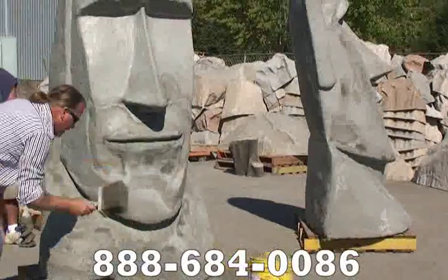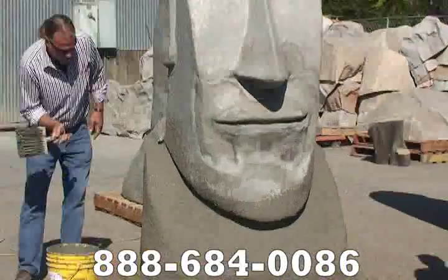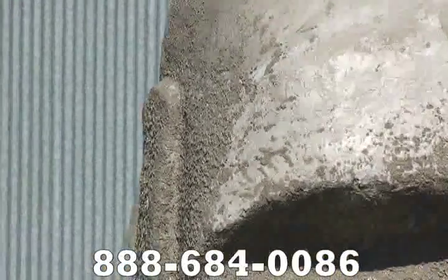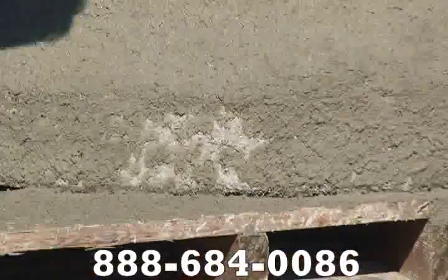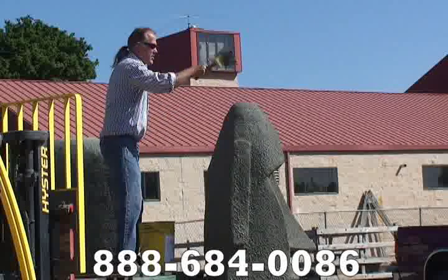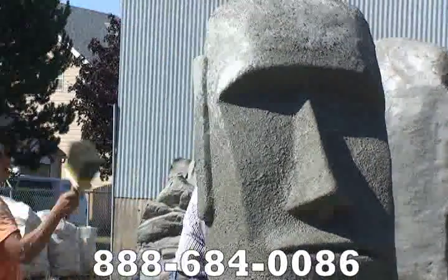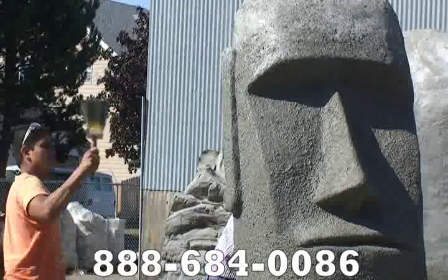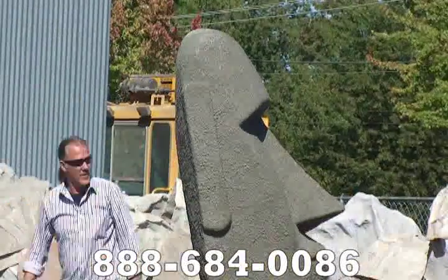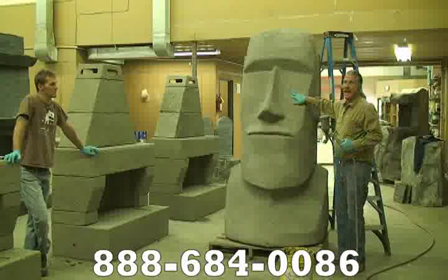Now we've got it outside. I took it over to this shop because this parking lot needs to be resurfaced and splattering does tend to get messy. The dash brush — we've got a concrete pump, I could have blown this on, but my concrete pump takes about a bucket and a half of mud to fill, where this was only a three-bucket operation. The pool deck brush is my oldest form of splatter texture and I like the effects of it more, especially not having to hear the pump and clean it. Within about a half an hour, we had those three statues totally textured. Then we let it sit overnight and came back with a fiber grinder wheel and knocked it down.